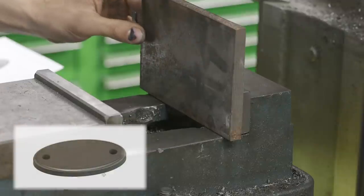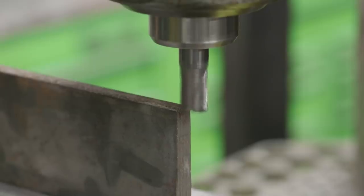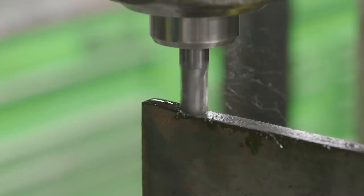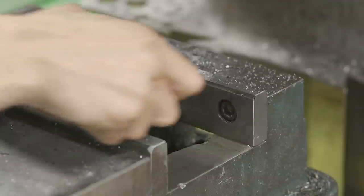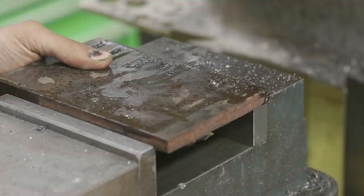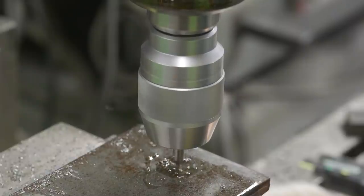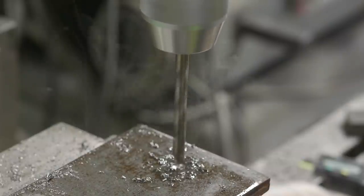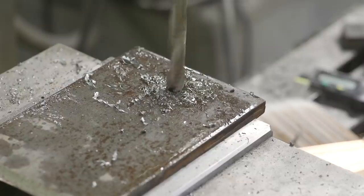The first thing we need to do is make this base plate. Here's a 3D rendering of what we're going to be making. We're using a 5/8 end mill, just trying to get one face cleaned up so we can get it held in the vise and it's relatively square. The first step is going to be drilling the holes and making sure everything is aligned. Referencing the diagram, these holes need to be about four and one quarter inches apart. We start by getting everything spotted and then move over to a half inch drill. The accuracy is not that critical here, so going straight to a half inch bit is no problem.